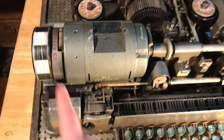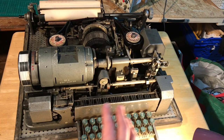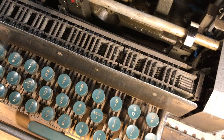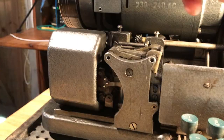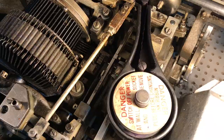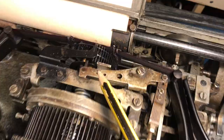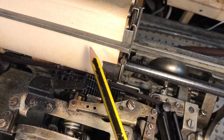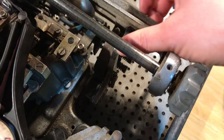There are adjustments in here so you can get the speed synced up with all the other teletype providers on the network. We talked last time about five-hole telegraph code, and you can see here the mechanism that translates key presses on this keyboard to a series of noughts and ones that get sent down the wire to the other teleprinter. And this is also involved in that operation — that's the main bit of the transmitter section. You can see it kind of mirrored in the receiver section — this is the part of the machine that selects the printhead through a complicated series of rotating cogs, kind of in reverse to the bars in the keyboard. That will press against the ink ribbon and print the character that you want.